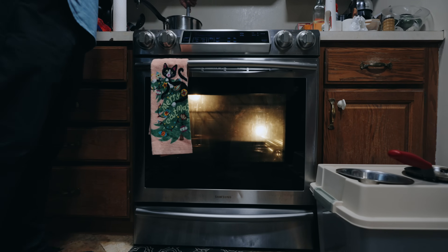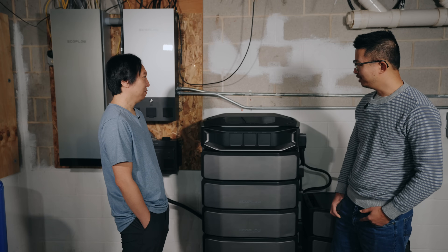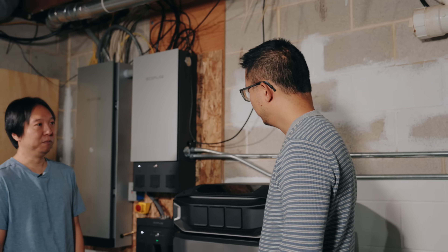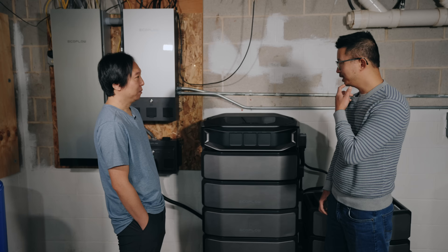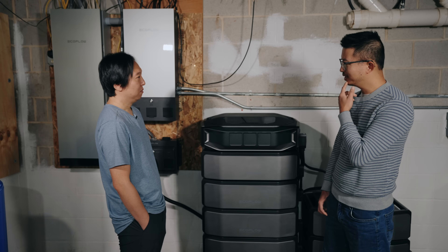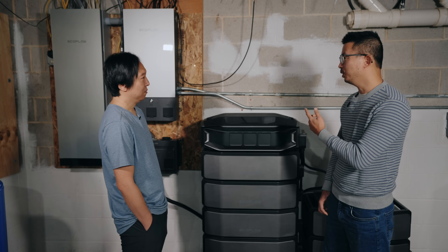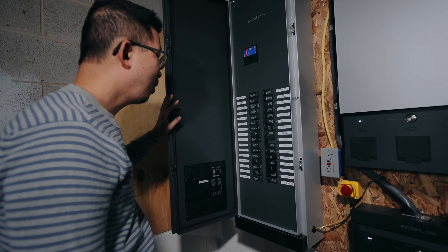For a house that uses so much electricity, one DPU might not have enough solar to carry through the day. I think you need a large array because one DPU can take a maximum of about 5.6 kilowatts of solar input. You would need multiple inverters for that.